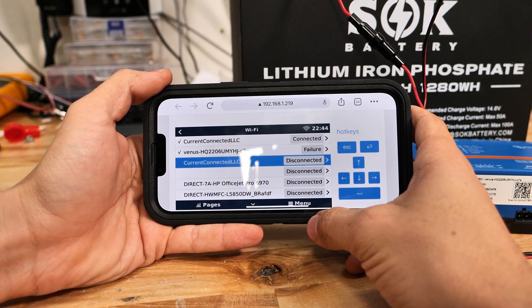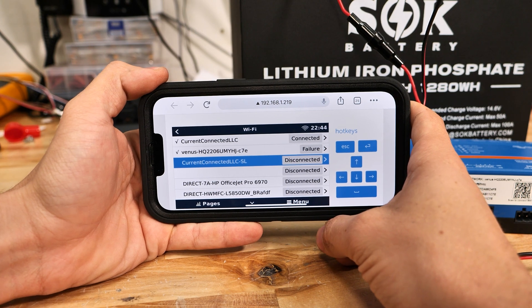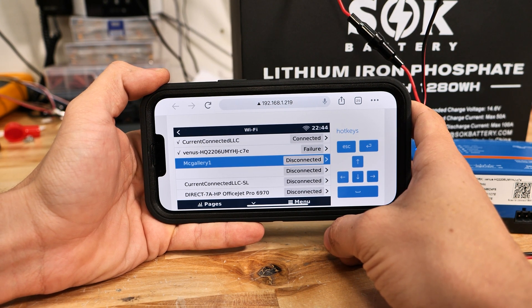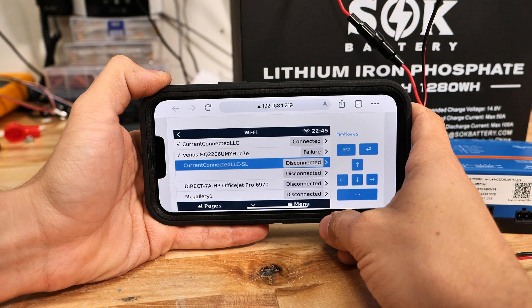So that's something to remember. At the end of the day, you need to make sure both your phone and Cerbo GX are on the same Wi-Fi network, otherwise you will not have a successful connection. And Bluetooth alone is not enough to have a Remote Console session. Hope this helped, and we'll see you in the next video.